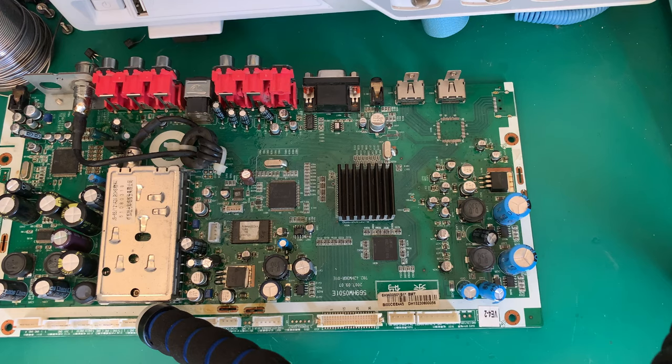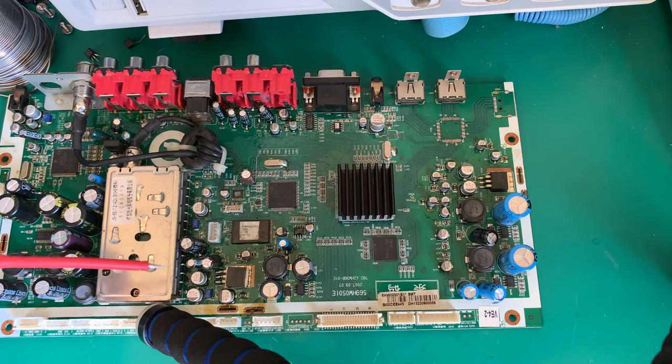I can tell you from my tests that this board, we've got these connectors down here on the bottom lower left that I've got the tripod mounted on. There's a 5-volt supply that comes in there, and my first observation with this board before replacing all these capacitors, this board pulls the 5-volt rail down to ground, so that tells me there's a short on this board. We can see the previous repairer had a go at this 5-volt regulator in here. He didn't put it back very neatly or anything. So he might have suspected he had a problem and then gave up.